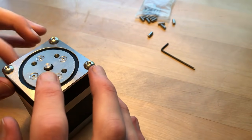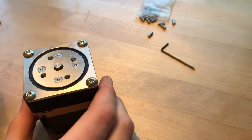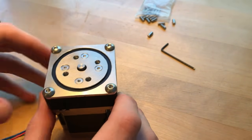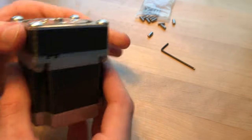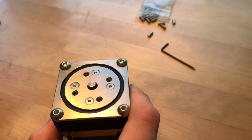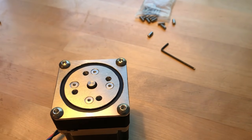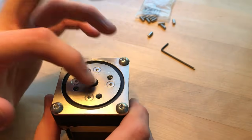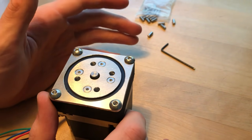It's too rigid. The motor cannot overcome the friction in here. So what I'm gonna do is take it back apart and take this base 3D printed piece, and those holes that are in there, I'm going to drill them out more, by like 0.5mm, I think. So each of those pins will have room to move around a little bit. I think that'll give me a little more room and hopefully I can get this thing to turn smoothly.